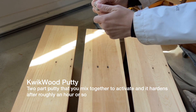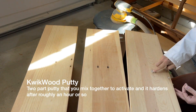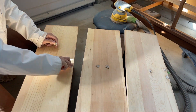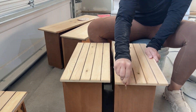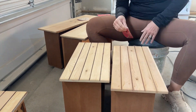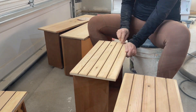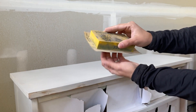This is great stuff to use. All you do is mix it together and fill in the holes. I like to tape the back so that none of the putty comes through. It takes about an hour or so for this putty to dry, so I will let it dry and move on to something else before I come back and hand sand over it to make it a nice smooth finish. I grabbed those other drawers that have the wood slats in them and hand sanded in between those areas using an old sheet of sandpaper folded in half and sanded until all of the finish was removed. By then my primer was dry and I moved on to using a fine grit sandpaper and a sanding block to lightly sand the primer before spraying my paint.